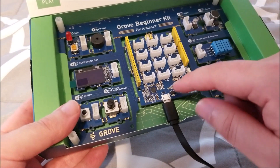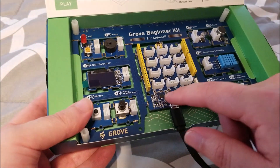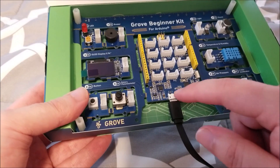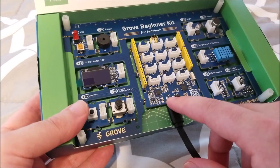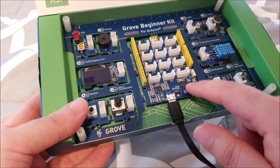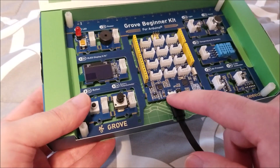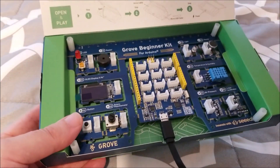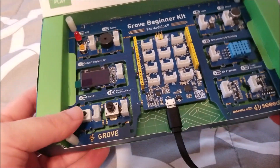This is a standard Arduino Uno even though it looks a little different. They're using smaller packages for the ATmega, and then there's the 32U2 which contains the USB serial bootloader. When you go to program the main ATmega chip, the 32U2 acts as a USB serial bridge. As far as I can tell, this is 100% Arduino Uno compatible, which is really nice.